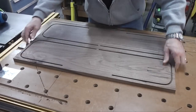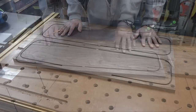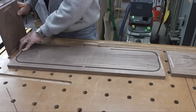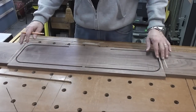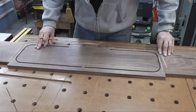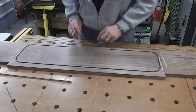I need to start getting these ready for the joinery and, of course, making the sides and the interior case pieces. This is how I'm going to attach the sides to the bottom and subtop of the hutch — they're going to be held in by rabbets. I don't want to see any end grain on the sides of the cabinet. I've already marked out which pieces are going to receive the rabbet. This is the bottom piece, and on the bottom of the hutch, these need to be stopped rabbets. I've already made some marks — I'll carry those over the top so when I go through the router I'll be able to stop.